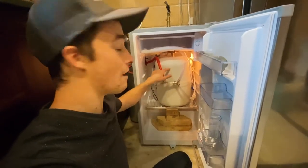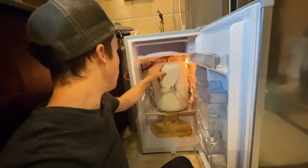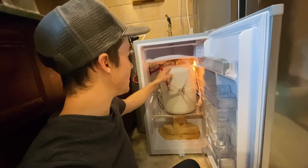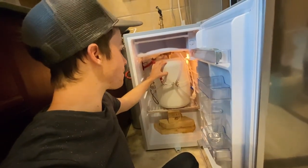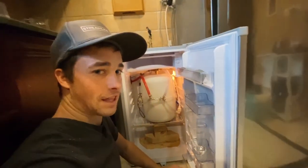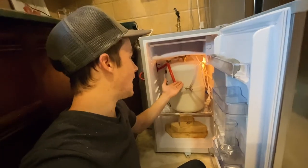But that can leave the tank not full. It's quite hard to get the tank completely full without releasing the head of air, and I don't have an air release. Adding an air release would be really wise in this system. One way you could do it is when the system is idle and you're just taking water out, you turn off the regulator so you don't refill the system with air as you take water out. Water would go out, and the air would be able to expand, filling the void of the water but with less pressure. Then you could pump more water in, and the system would always just go back to the same pressure. So it takes a little bit of methodical thought about how to get this to work super smooth.